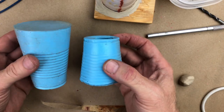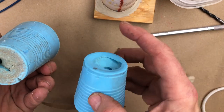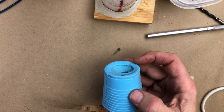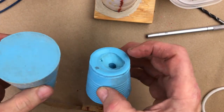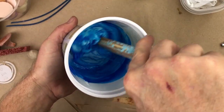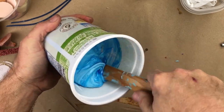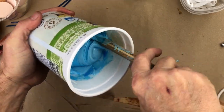I'm pouring two molds today. The smaller one is our jackrabbit, and the other one is a commercial job I'm going to pour at the same time. I keep a lot of old molds around, and they come in handy — all I've got to do is find a couple of old molds that are the exact same size as the cups I'm going to pour today, weigh them out, and I know exactly how much rubber to dispense. I changed the ratio a little bit — there's a little more hardener than you technically need. You really need 10%, so 300 grams of rubber and 30 grams of hardener. But I put in a little more because it's chilly and I need this stuff to cure.